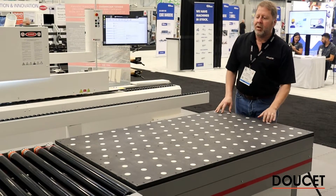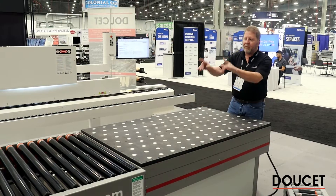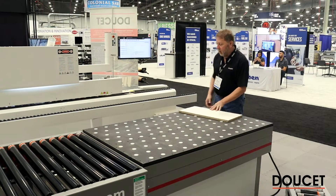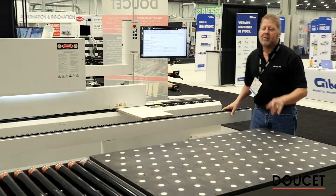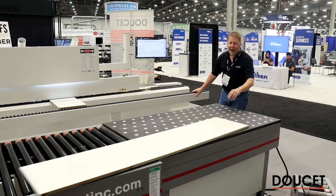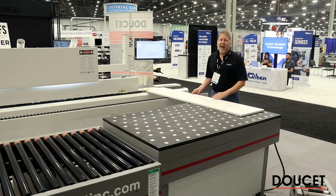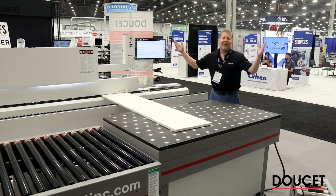The air table from Doucette Machinery has an internal blower. It mates up with the BT3 and makes handling of your panels effortless. It can come in various sizes, but it really excels when doing larger parts. With a foot pedal, you can raise the original part up and feed it back in at the work height of the edge bander. It's that easy and you're done.